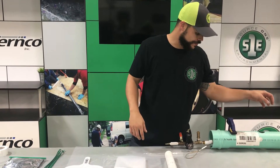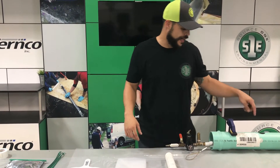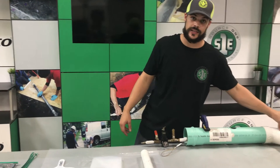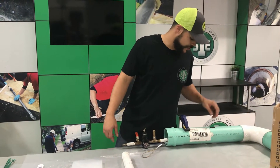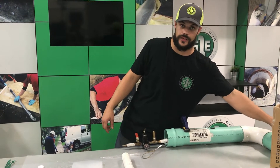First, when you're doing your test inflate, you're going to make sure that it's packed up on each end of your packer. These packers are made to open from the center out, so if you just did a center hole it would open in there first, so you want to make sure that each end is fully packed out to get your pressure.